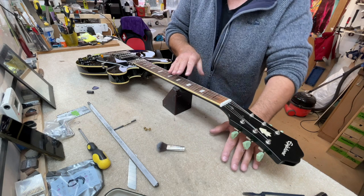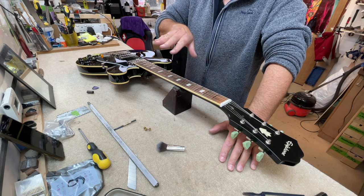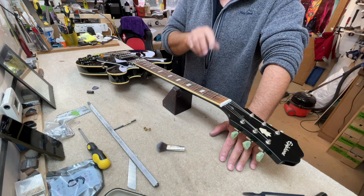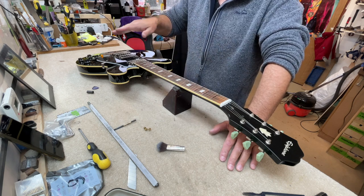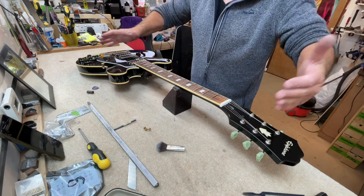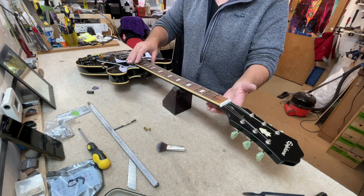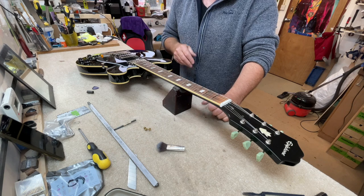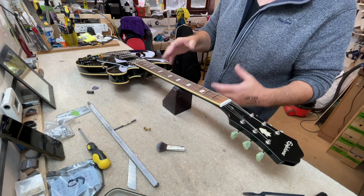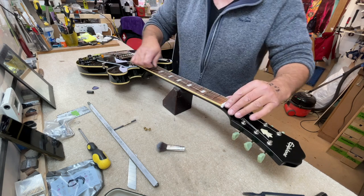When I noticed they were in clusters of two and sometimes three or more, I realized that what I was looking at was more than likely, rather than somebody over pressing two frets in a row, a slight variation in the board. And what I know about wooden necks is that when you compress them longitudinally, they not only try to curve upwards because the headstock's trying to pull up, but principally they're trying to compress lengthways, and that makes the wood do things slightly differently than you'd expect.